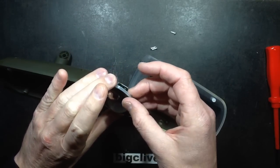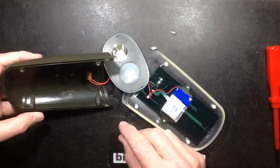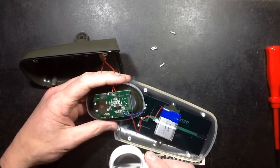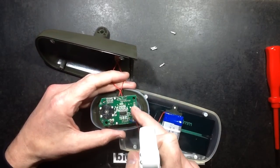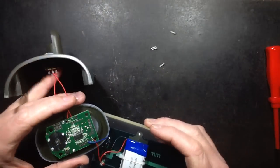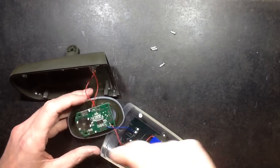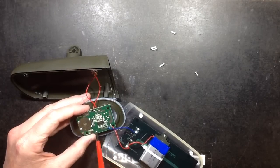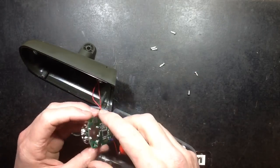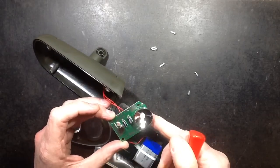The detector PCB — I'm looking at all this sealing, which is quite good. And there's sealing on the rest of the case as well. This probably has a fairly standard PIR chip in it. It's quite odd — all the plated through-holes; it's covered in them. There's the PIR sensor with an LDR, so it only lights at night. A couple of electrolytics, not much else on that side other than the LED.